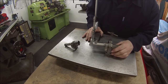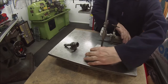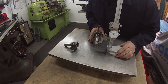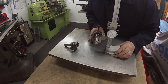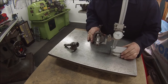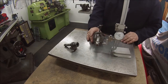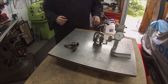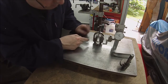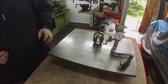The surface finish of this pattern one isn't great, it's a little bit choppy, but if I swing that round so it's in the camera, from both sides it's tracing across the surface just nicely. So that's my level point there for this one. You can just about hear it hitting the corrugations, the ridges on the machining there. So then, if I measure this point here, between there and there, that'll give me a reference.